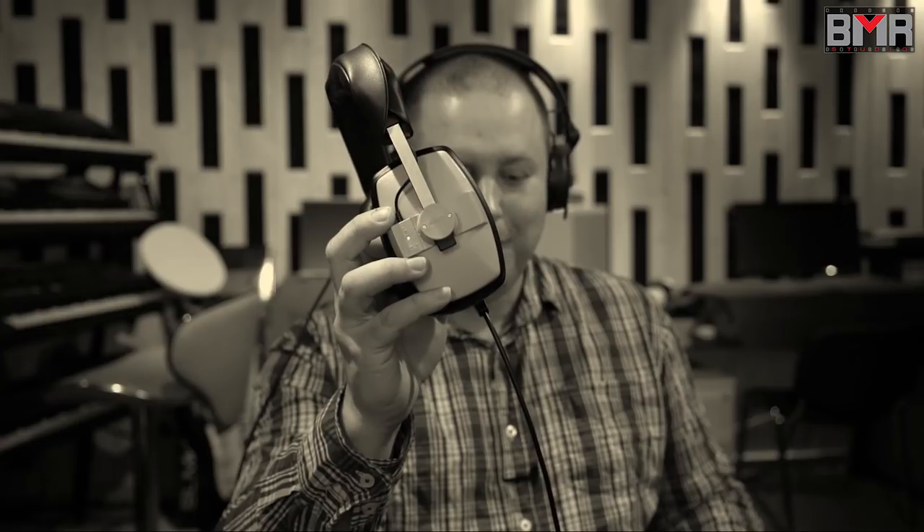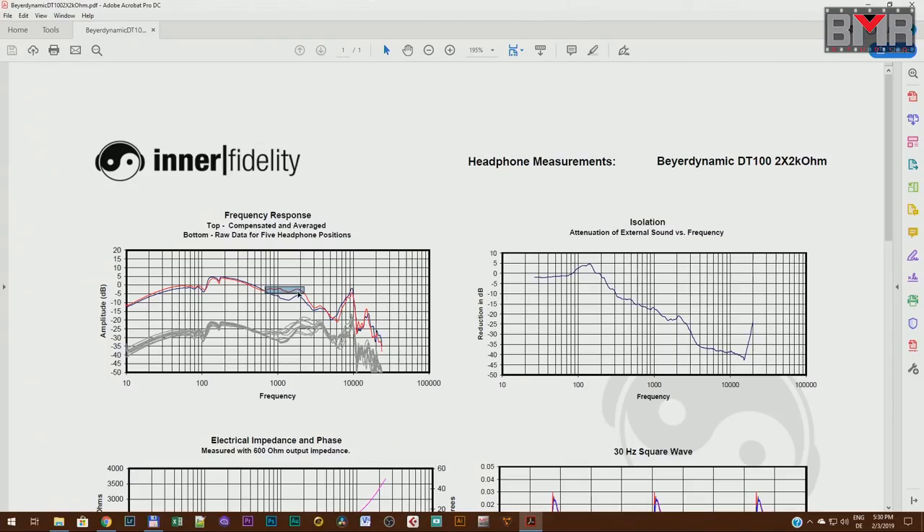Not because of the sound — if you ask me, this DT100 has a horrible sound. It's not good for listening back music or mixes in 99% of cases. But this headphone has the best isolation currently on the market — we're talking about minus 45 dB isolation on specific frequency ranges. When I say it has a horrible sound, it's kind of true and kind of not, because this Beyerdynamic DT100 is the NS10 of headphones. If you have a problem in the mid frequencies, this headphone will scream. Time to time I pick up this headphone to check my mixes. It's almost linear — we're talking about 1 dB fluctuation.